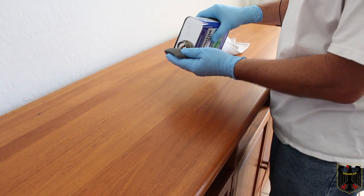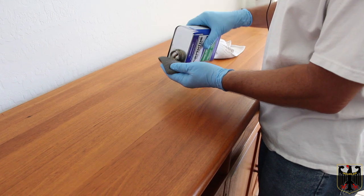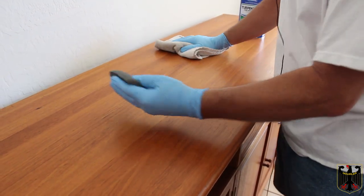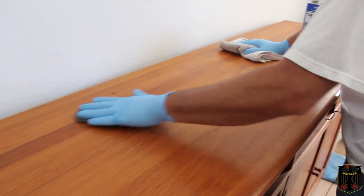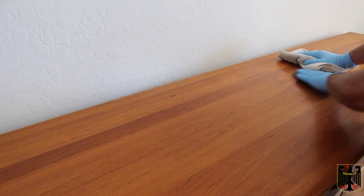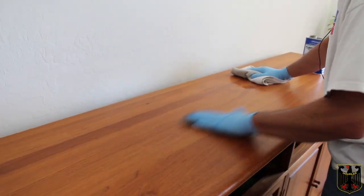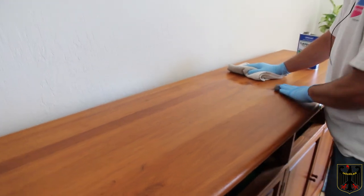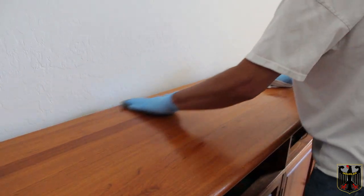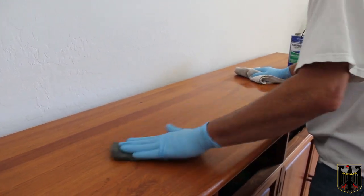To start the cleaning, you put a little bit of turpentine onto some steel wool, and you have a cloth ready at the same time, because this will tend to flow over the side. You want to go with the grain and just go lightly — you're not going to rub real hard. All we're doing is removing things like pollen and dust that have accumulated on the teak. We're not trying to take any finish off; we're just trying to clean that top surface.